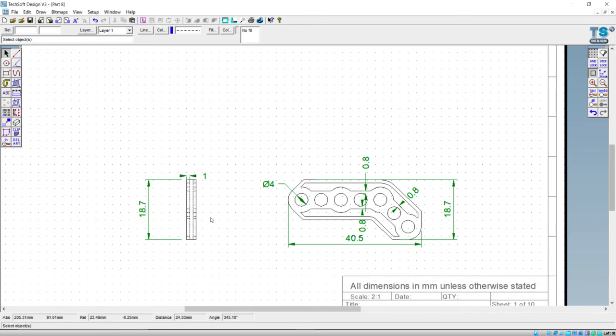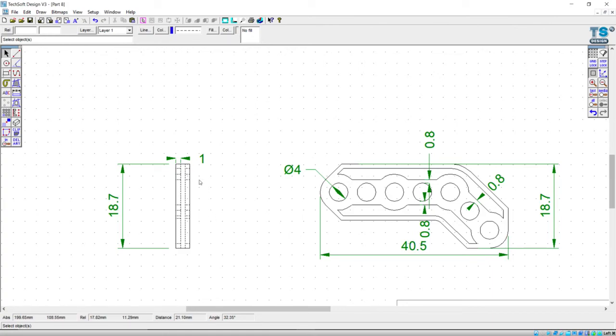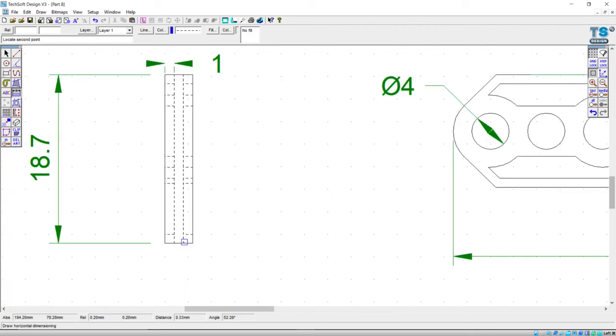And that's apart from a bit of dimensioning here now. So let me do one for you. We don't want to go crazy with the dimensioning, but we do need some dimensions. We already did the 1 millimeter there, and I probably will restore the 1 millimeter dimension down here. So we know that they go 1 millimeter in from each side. What else? I'm feeling I've done something not quite right here. No, I think we're good. Right. So a few vertical dimensions, for example, this one here.